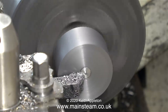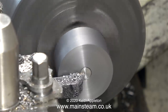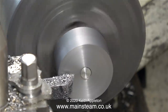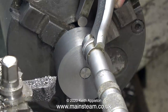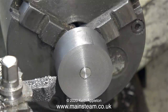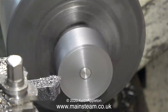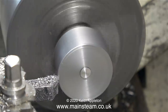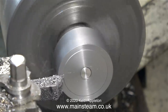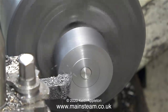I'm reducing the size of the piece of stainless steel incrementally. This might look like a large strong part but don't forget it's only held in the chuck by the 5/16 inch diameter piston rod. The best thing to use for jobs like this is a collet - if you have a proper collet set they're ideal. But luckily this chuck is fairly accurate, and even if it wasn't, by the time I turn the outer diameter longitudinally the outer diameter of the piston will be concentric with the piston rod.